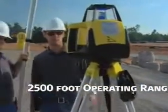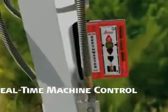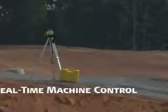The Leica 400DG also serves as a real-time, grade-matching, machine control instrument when paired with a Leica MC200 DepthMaster sensor attached to an excavator or a backhoe boom, and Leica MC1200 laser sensors on the blades of graders, dozers, and other earth-moving equipment.